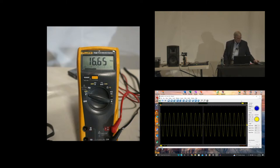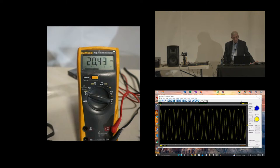All right, sorry for that. So you can see the 1,000 hertz on the oscilloscope there. And if you keep running it up, eventually the amplifier gets to a point where it starts to clip. This is literally the definition of an amplifier clip: you're feeding it a sine wave and you see where it starts to clip. If you keep going, it squares off even more. It'll only go so far, and then it'll stop. How far that goes depends on the rail voltage that's feeding the output. So if you want to measure the power of an amplifier, you get it below clipping.